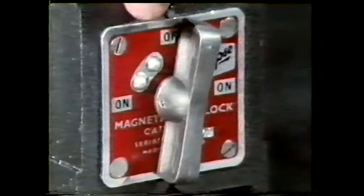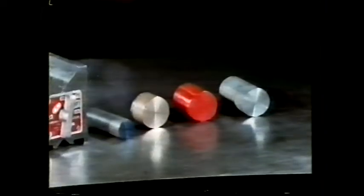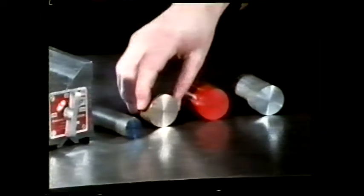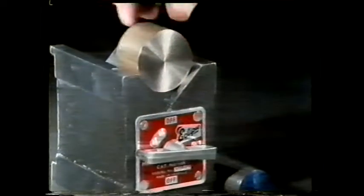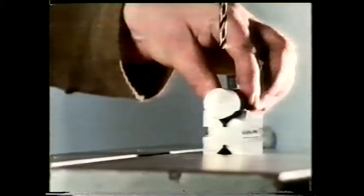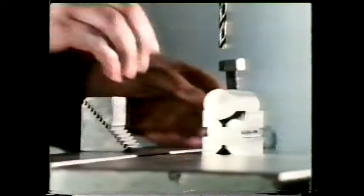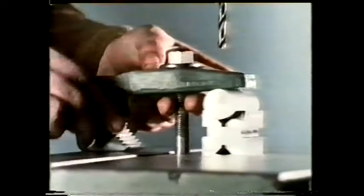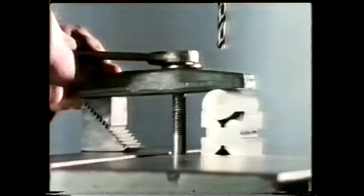Can we use these magnetic forces to restrain any material in the block? What about brass, a plastics material, or aluminium? Let's try brass — of course, it's not a magnetic material. A V-block is often used to hold a circular component when drilling. The block and work can normally be restrained by clamping them to the machine table. Packing is needed under the other end of the clamp, and it should be high enough to keep the clamp horizontal.